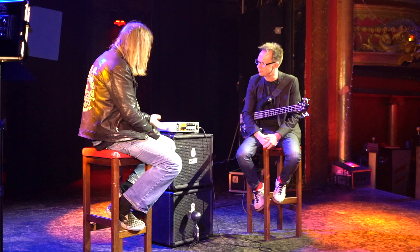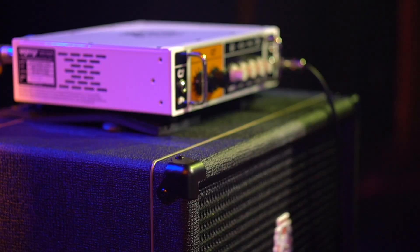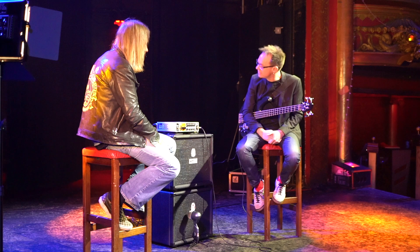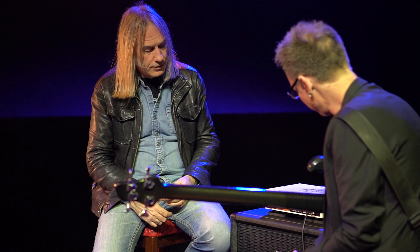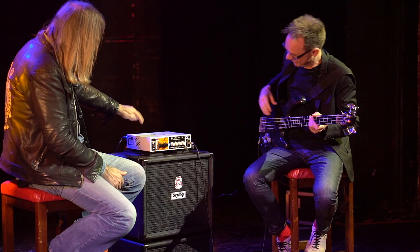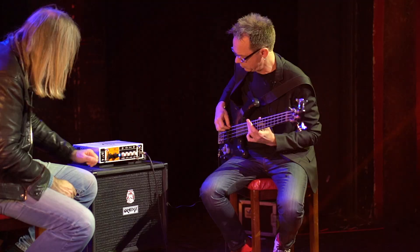You can carry one of these cabs with one hand, and two of them make a nice little rig, especially for smaller venues. Can you run them in series — say four of them? If you wired your cables you could series the cabs together and take the impedance up to 16 ohms each. The overall impedance would then be eight ohms, so you're not getting the full power — this will make 250 watts at eight ohms. It would just look cool with four of these though! Because it's class D, the math halves on impedance: into one eight-ohm cab it'll be making 250 watts; into two cabs or a four-ohm cab it'll be making 500 watts.